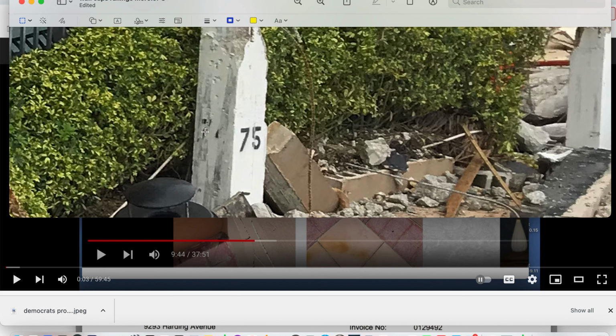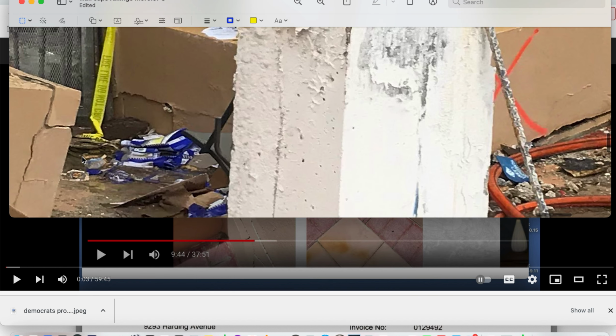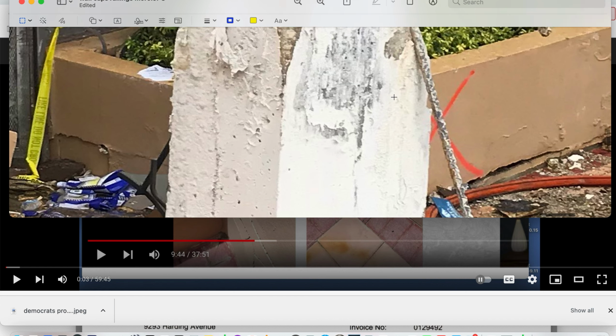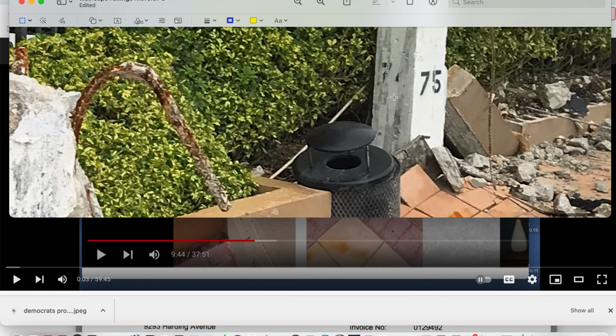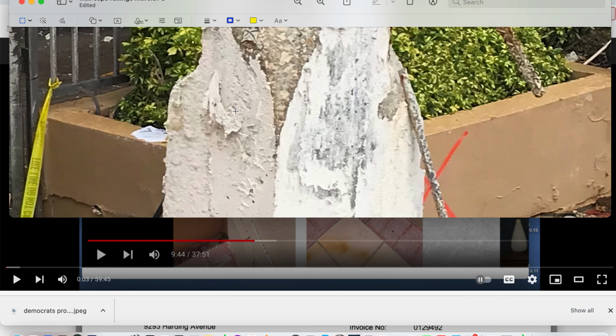So over here we see our butterfly, my biased butterfly. So here's that. My downward force is here. For professionals new to butterfly roofs, 1950s, 1960s, they had the roofs come in like this, and the gutter was in the middle. They called them butterfly roofs back then. And this reminded me instantly when I saw it, I said, looks like a butterfly roof. And it's punching shear, so I coined butterfly deck punching shear, butterfly deck failure, punching, where they both go at the same time, the left and the right.